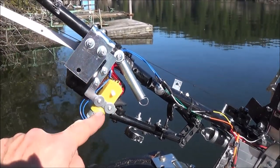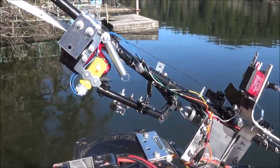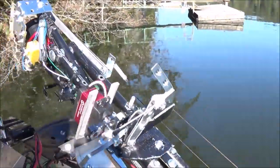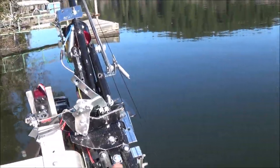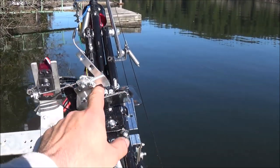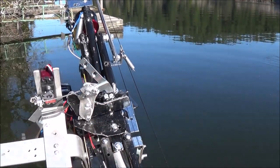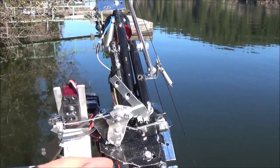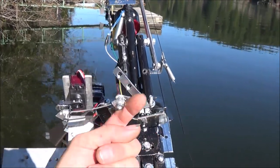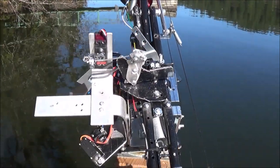I've attached an electric motor to drive the reel itself, going down to automation so that we can control that from either the laptop or the cell phone. Back here we have a latch catch system, so when the pole comes down it'll hit against this, that'll push down to lock the fishing pole into the system and make sure that nobody can get hurt by it. When you actuate the servo from your control system, that little latch will pop up releasing the fishing pole, allowing it to go through the cycle and throw the line out there.